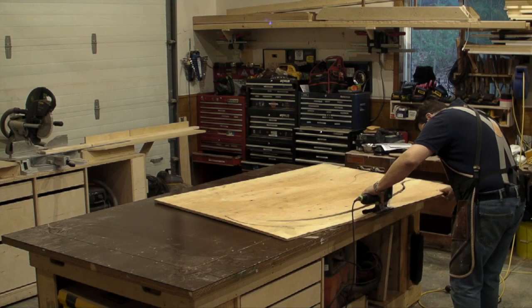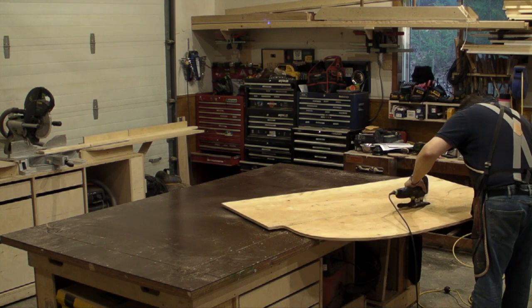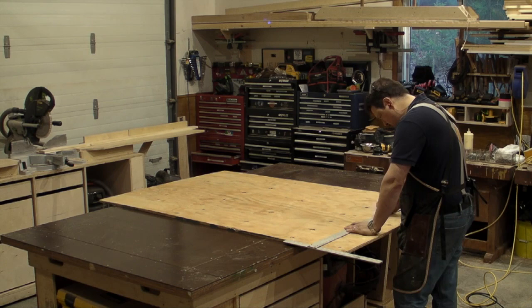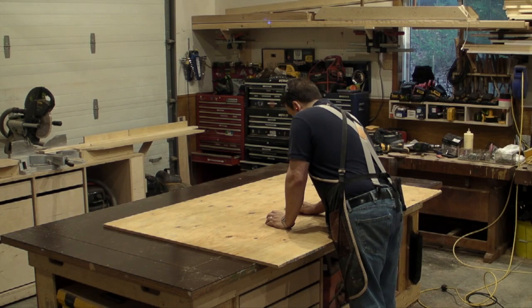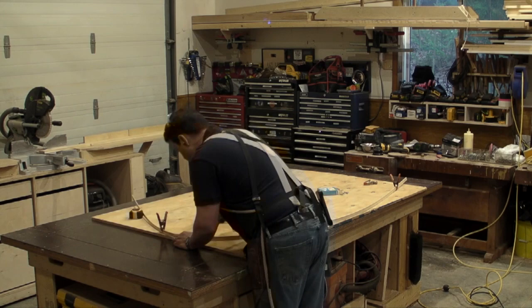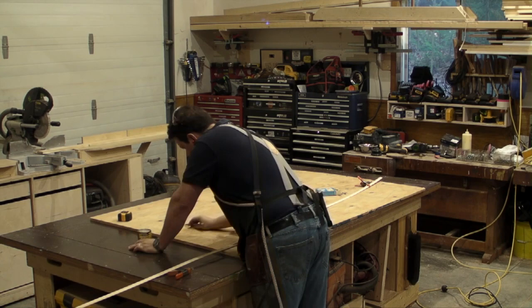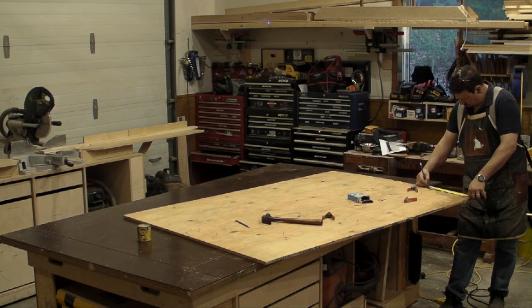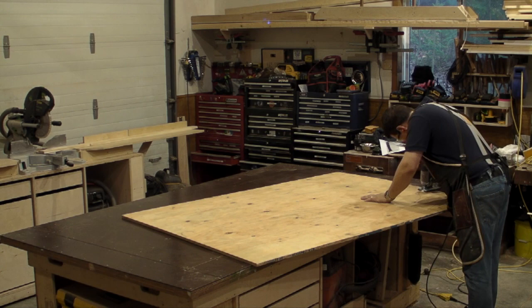There's a lot of plywood offcut when doing this kind of sculpted scenery. As I go I cut it into smaller pieces and work through to get all of the profiles. There are five vertical bones here and I do the exact same thing — using a grid pattern overlaid on top of the bones, measuring out, moving nails until I get the outer curve I'm looking for. I use a paint can for the round nose on this thing, then work out the inner curve and figure out the geometry until I'm comfortable, then jigsaw it out.